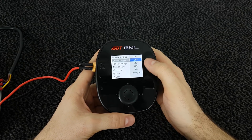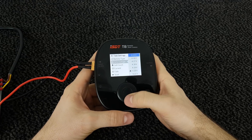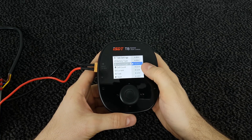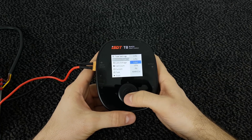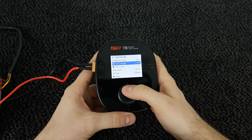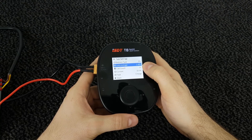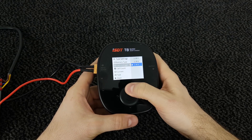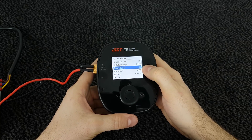Switching to lithium polymer, we can set the voltage from 4.15 to 4.25 volt. For lithium ion, 4.1 volt is the nominal charging voltage, with a minimum of 4.05 and maximum of 4.15. For lithium phosphate it's 3.6 to 3.7 volt. For lead acid — for example a 12 volt car battery with 6 cells — you need to change the cell count to 6. The recommended cell voltage is 2.4 volt, and the minimum you can go is 2.0 volt. This is the charging setup for a lead acid 12 volt car battery.